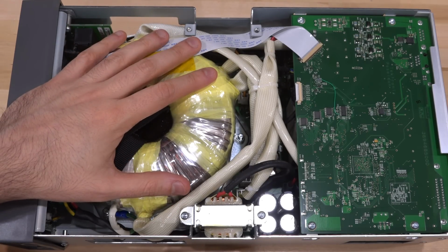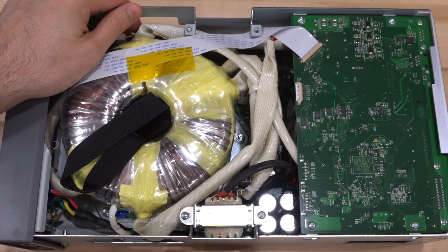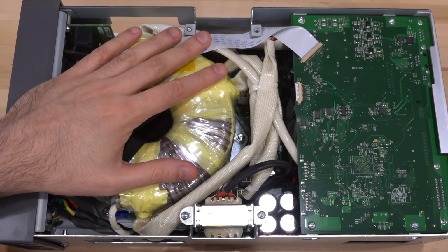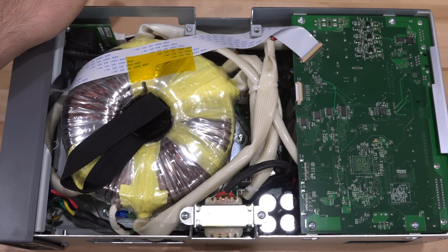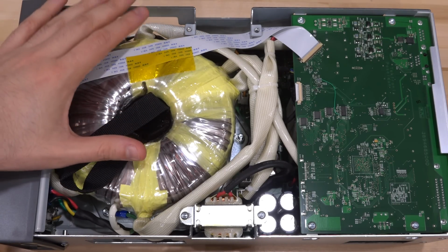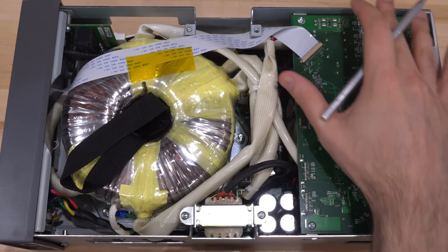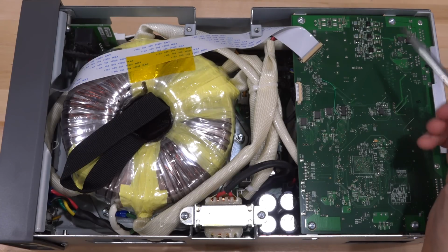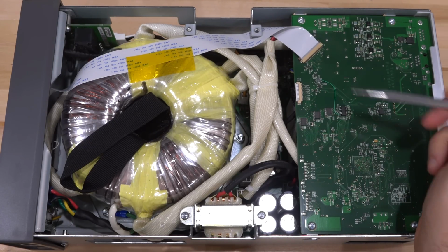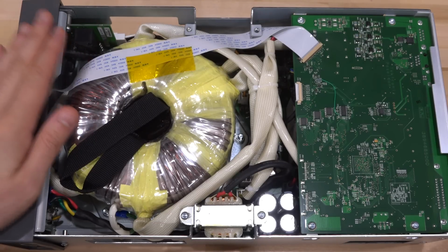Now, you need something this size and of this quality, of course, not surprising from Keithley, to get the kind of performance you're getting from these kind of power supplies, and this is very common in their designs in general. Now, the instrument is broken up into multiple sections, as it often is for units of this class. We have a digital board, which has all the communication and all the interfaces. This is typically common between several classes of power supplies, and this is probably the same, and there are some hints on it as we will take a look. There's a little bit of a bodge wire on this one. And then we have a ribbon cable that goes from here to the front panel.